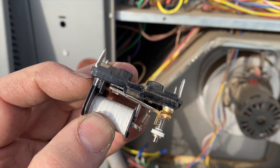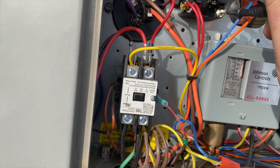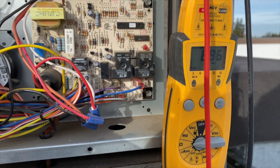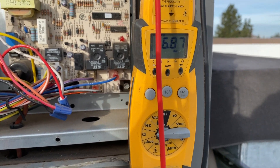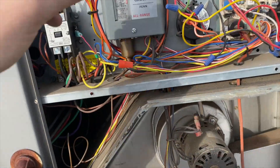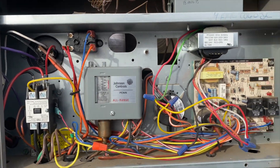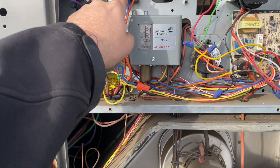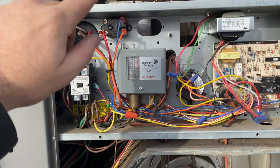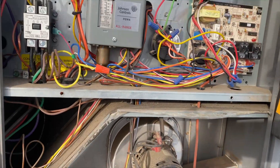The coil might be dead, so let's open it out and see. We've got our relay back in place. The ohm reading on the coil is 6.86 kilohms — it should be about 10 to 25 kilohms. So we just don't have enough resistance to create that magnetic field. I'll put it back together, cycle on heat, put the side panel back on so it doesn't overheat, and this bypass should keep the fan running until I can get a new relay ordered.